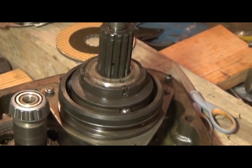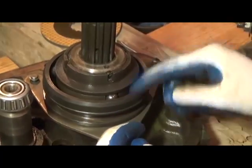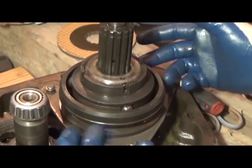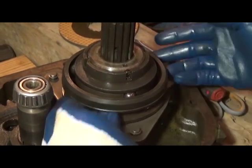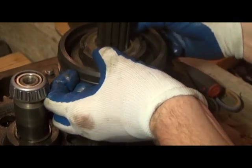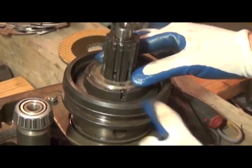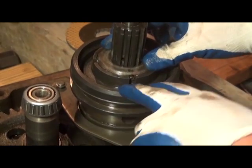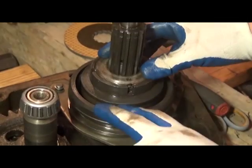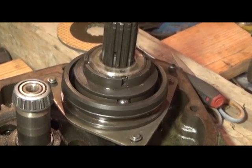Okay, I'm going to illustrate a little bit on overall how the clutch mechanism engages and disengages and works. This is in the disengage position. Imagine the clutch pack up here. And what we actually do, there's two brass forks sliding on a collar. You engage with your foot or your hand lever. The collar slides up, snaps into place. It kind of snaps over center, just like the hand clutch on your tractor in a way. As long as there's pressure there, your power shaft clutch stays engaged. To disengage, you pull your lever back or push it back with your foot, and then it slides down and disengages, releasing pressure on the whole assembly.